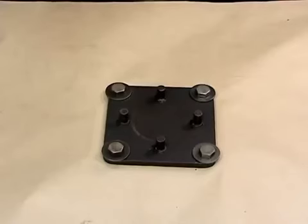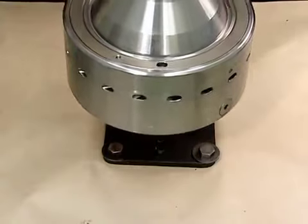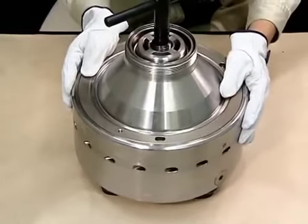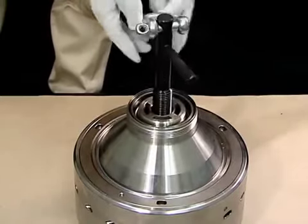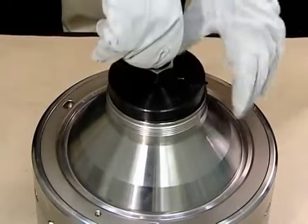After removing the bowl from the self-jector, place it on the disassembly stand. Be sure to align the four pins on the disassembly stand with the grooves on the bottom of the bowl. After setting the bowl, remove the bowl lifting jack and set the disc clamp plate.